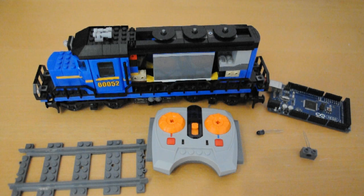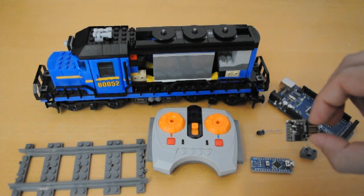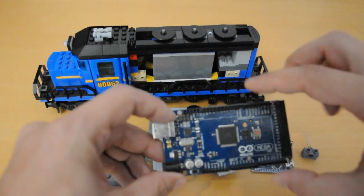Using these LEDs and an Arduino control board, we can write programs on a computer to control the trains automatically. It doesn't matter whether you use a big Arduino Mega, the little Nano, or even this tiny DigiSpark. For a single train, all we need is one PWM pin like these ones here.